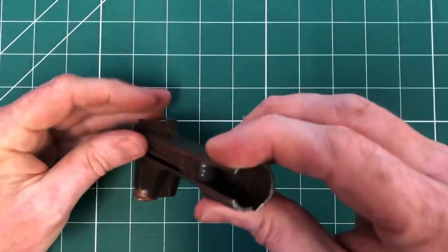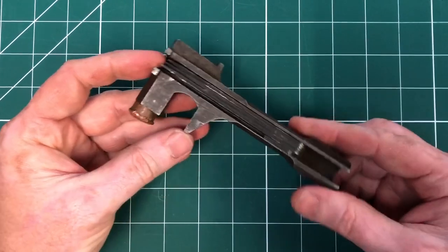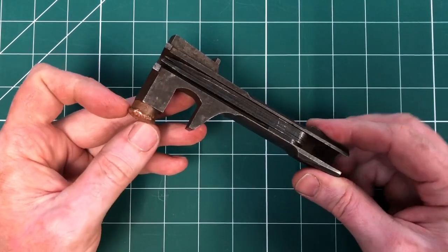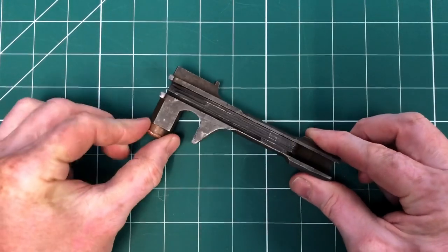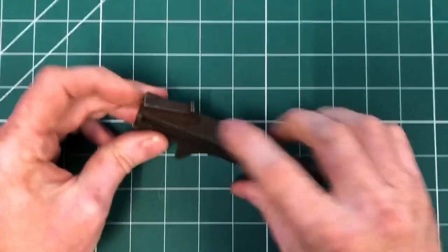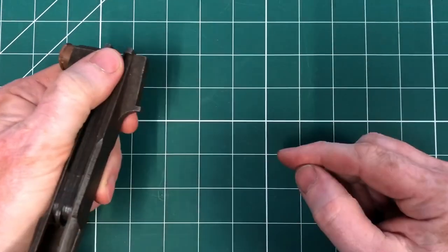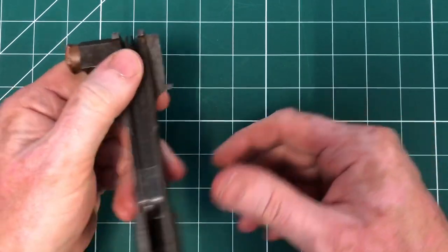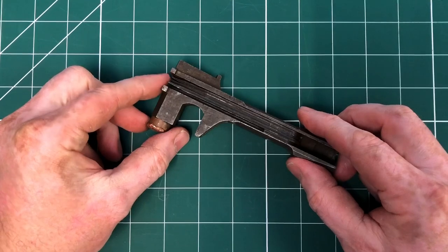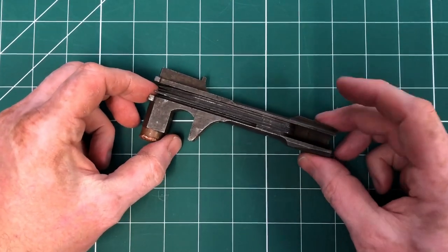The body of the combination tool itself — the copper hammer is pretty obvious: you'd use that for hitting things. The bar on the tool is used to turn the gas regulator on the inside of the Bren gun. You put that in there and turn it quite easily, which helps you set the gas and regulate the rate of fire on the Bren.